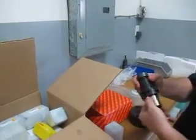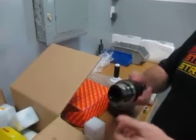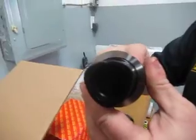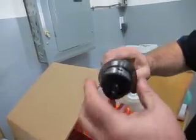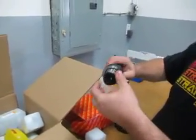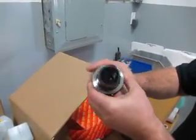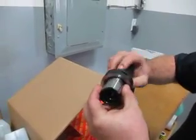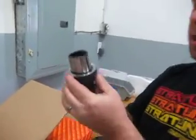We got chucks for our milling cutters and all the Sandvik Coromant Capto C6 tooling. The Coromant Capto is very, very cool — it's a tapered trigon shape that allows really extremely accurate location in multiple directions. It pulls up tight against the face and it's really solid because you get that much contact with your spindle.